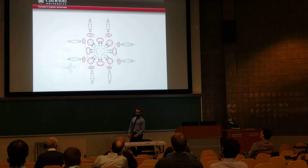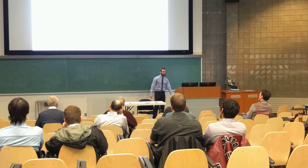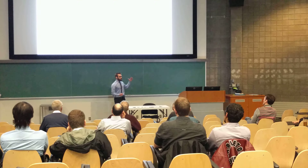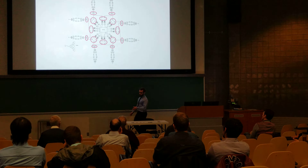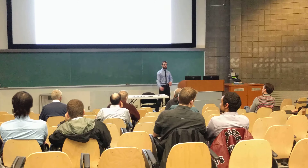Next is the corporate feed. We have a signal from each one of these antennas — how do we combine them? The corporate feed essentially takes two of these antennas in pairs and produces a sigma and a delta: an addition and a subtraction of the two signals to send to the DSP. This is important because we can use certain DSP techniques to find out exactly what angle each pair is receiving from.